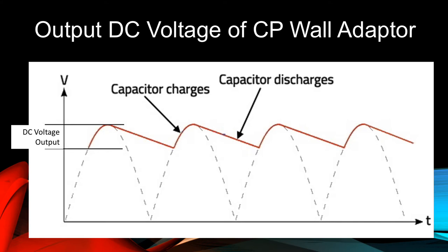However, the resulting DC is not yet ready to be used by the piano circuits. Ideally, the DC output should be ruler flat. The gold standard for ripple-free DC is a simple battery, which has no ripple. Since battery power is impractical for this application, Yamaha decided to locate the regulator circuits inside the harp section and not in the external adapter.